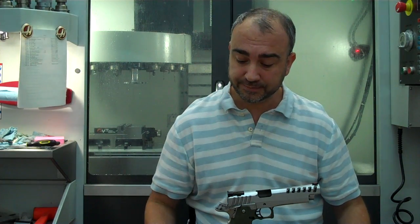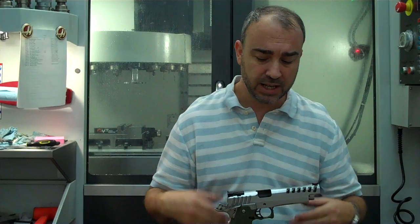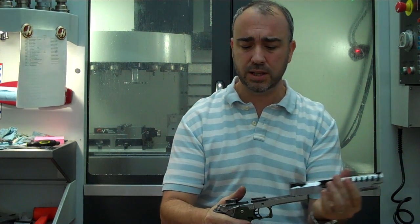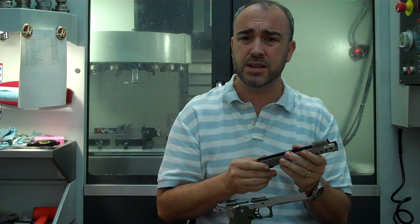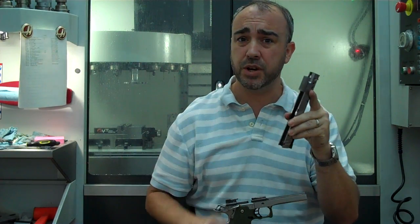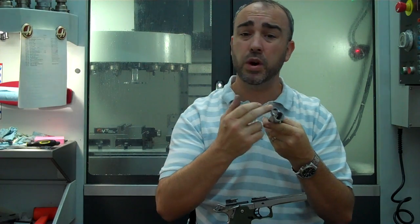And another thing, we had a couple of these so-called stroke guns come in the shop. The cut's not being performed properly. It's really not an intensive process. It only takes a few minutes, but it involves cutting material off the back of the reverse plug tunnel. Sometimes some people choose to ream the reverse plug tunnel forward. That's another option.